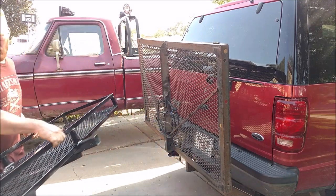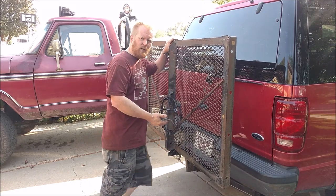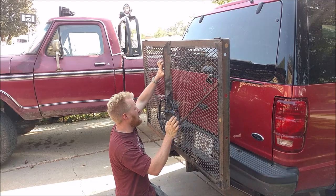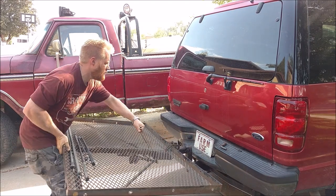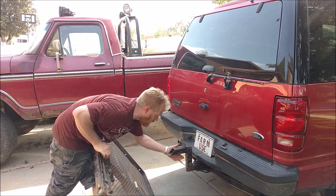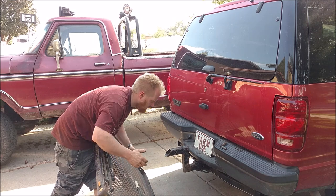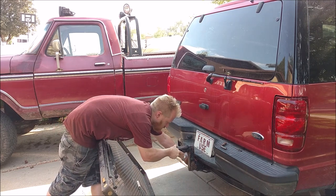Figured I'd show you the one I made years ago. It's almost twice as big — it's three foot by five foot. And it actually can mount in the upright position or typical, and the pin just goes in it the same way. There's a little screw that ratchets it down so there's no vibration when it's sitting here. But then we can actually just lift it up. When you do one that you can mount up and down, all you do is you pretty much mount a receiver on here, the same that's right here, and then you just have a tube that goes between them. It can just be straight — I had to do this one angled because it's so long. I don't want to drag it through stuff, so if it were straight it would stick so far out behind the vehicle you'd end up dragging it in different spots. But that goes in the same way it normally would.